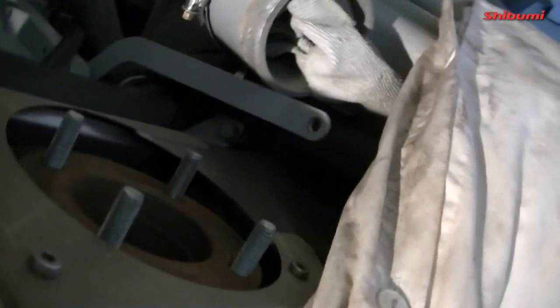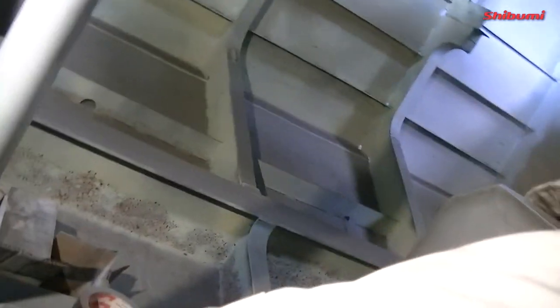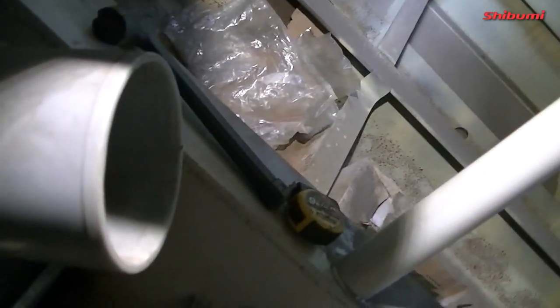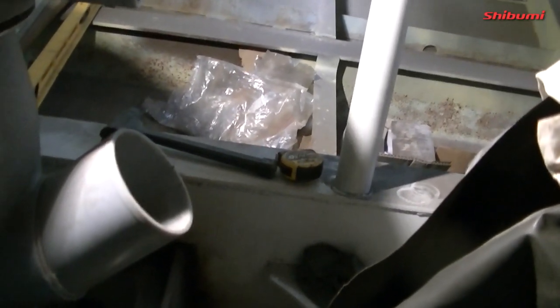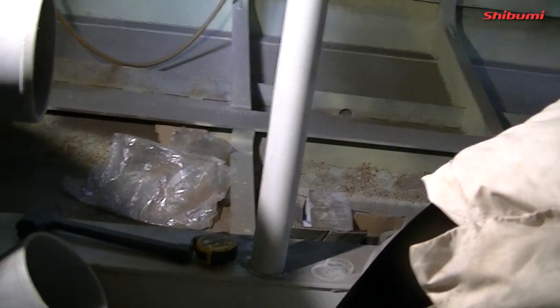It's going to be a tight enough bend to come out of the side of the engine there. You can't see it, it's actually exposed it slightly. So it's coming out of there on that and then down. I'll just rotate the camera so it's there and it'll come to there. So it's going to be a little curve like that. I'll try and keep as steep an angle as I can here and then flatten it out. So the exhaust hose might need a little bracket to keep it in place, to keep the curve the way I want it, which I can make. There's no problem there. I don't have any hose yet, so we're a while away from that.